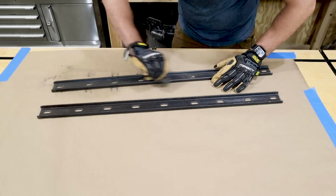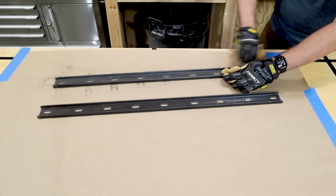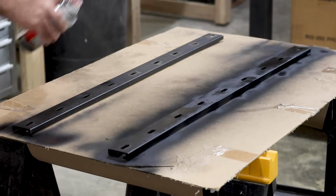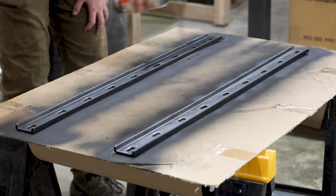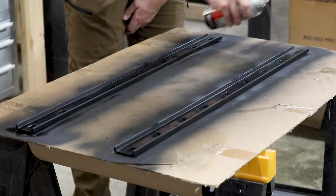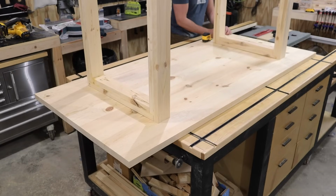I'm adding C-channel supports to both help brace the top and prevent any bowing. I have these linked down in the description, but they do come unpainted, so I use some steel wool to remove the surface rust and spray painted them black. Now that I know the placement of the legs, I can plan where to put the C-channels.